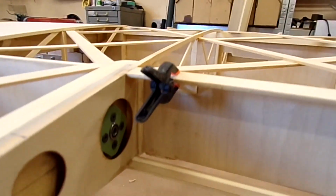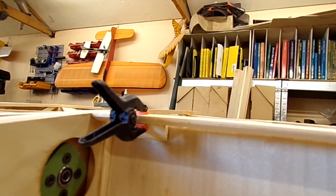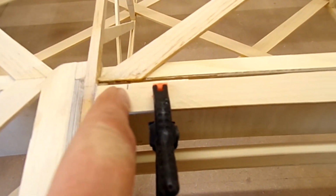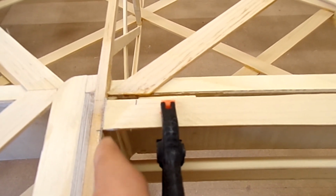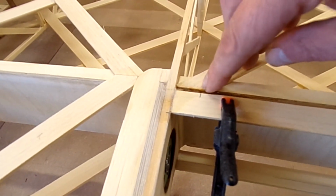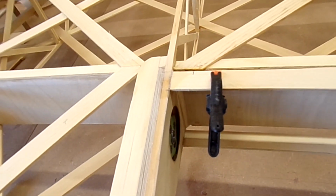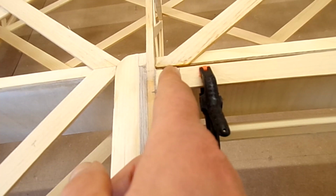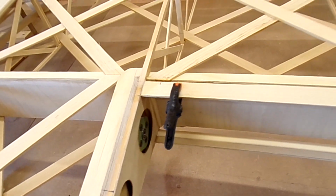So I've got the triangular piece bonded in there, 1/2 inch by 1/2 inch triangular, 1.5 inches long. And I've set it out 3/4 of an inch out from the face of my rib here. That should be enough space for the aileron control tube to go. This piece of geodetic here will probably have to be dressed back for the control tube. That little bit. And I'm going to cut through here on the false trailing edge, and that will give a clear path, as we found we needed it.